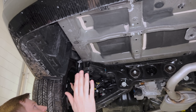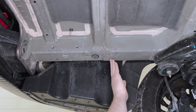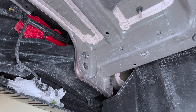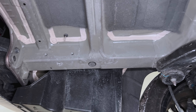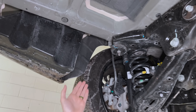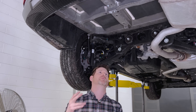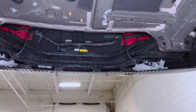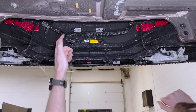Looking at the rear motor bay rails, you can see a nice progression of materials — a crush interface and a layered build of material for the rear part of the rails. Hyundai-Kia has been doing a composite rear impact beam forever. It has integrated features to support the rear fascia, wiring harness, and RKE antenna provisions. Still a few too many fasteners — you might mold something in and use one fastener if you really need it.